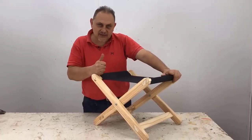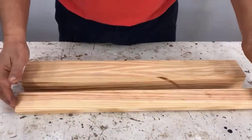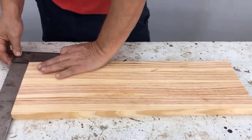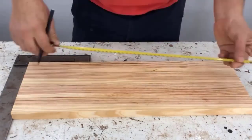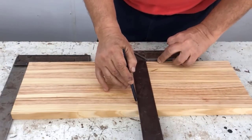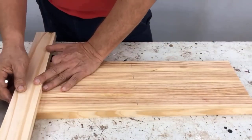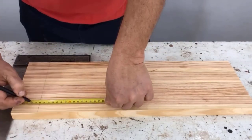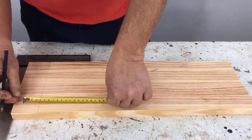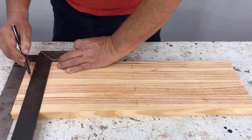Let's get started. We begin by marking the four legs, ensuring the tips are aligned using a square. We mark the center and also mark the top end with a six centimeter cross piece. We mark at one centimeter and four centimeters — this is where we will place the tip of the three-point drill bit.